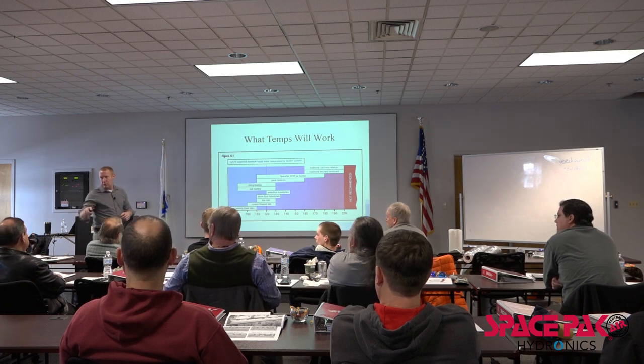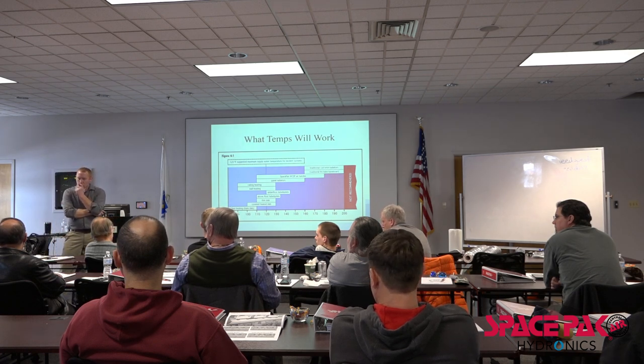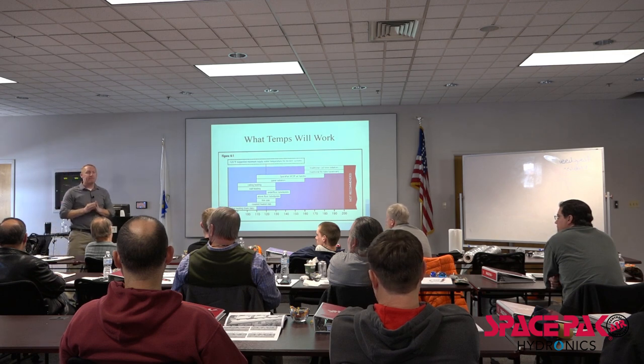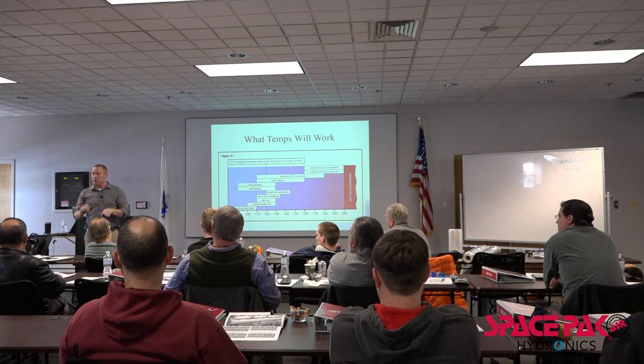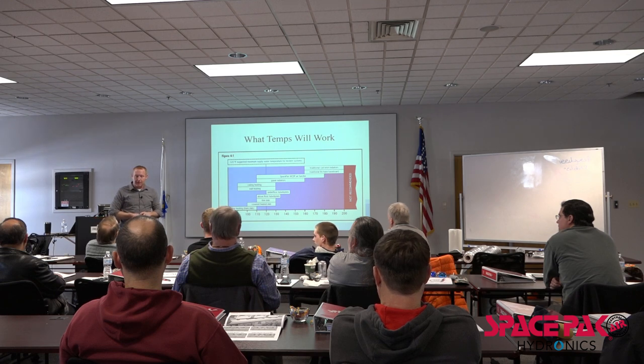Do you have a question? Yeah, because on the other slides I've seen it said it heats domestic water, domestic hot water. Yep. So we generally won't have these units be the sole domestic hot water provider, because generally you're going to want 120 degree domestic water or higher. We can use them to help supplement with a plate heat exchanger. There'll be a couple slides of that coming up that break that down a little bit more.